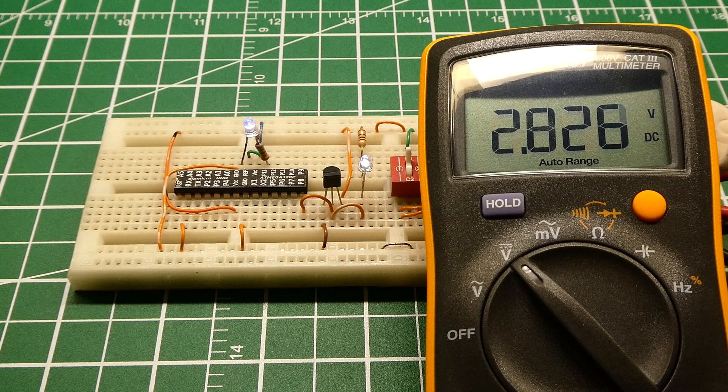And there you can see, at 2.8 volts, the low battery alarm LED has come on, and the flashing rate on the microcontroller has sped up — so it sensed the low battery alarm.